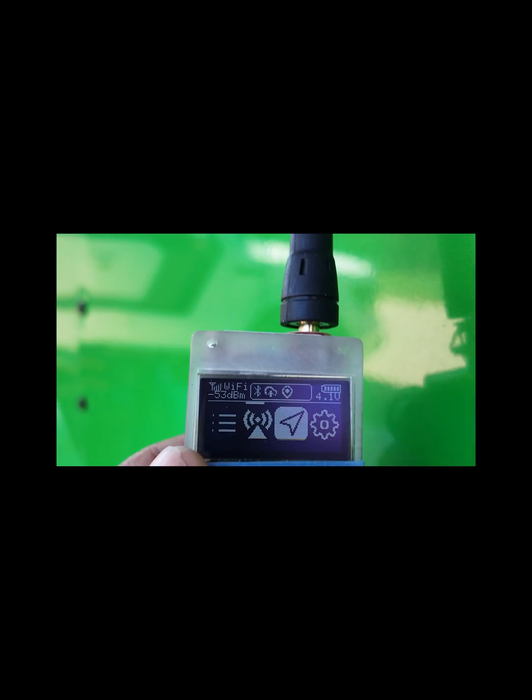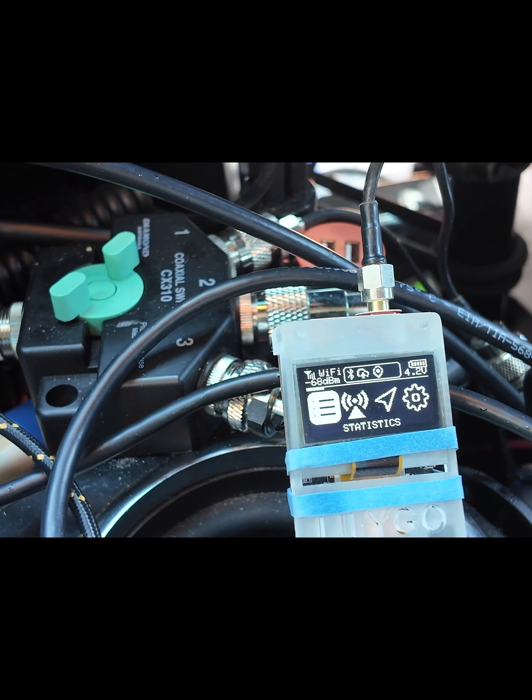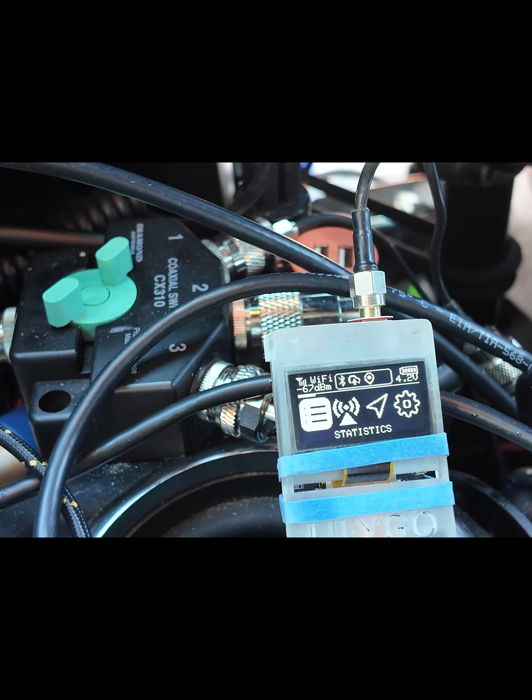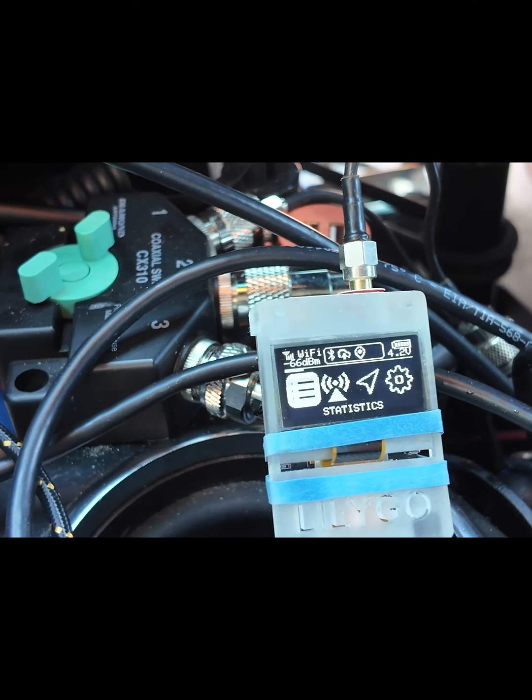If you look on top here, it's got a GPS. This antenna on top is a VHF antenna and it's SMA, so I just unscrew that antenna and hook up the one that's on the truck. This has been doing the job. When it's in the truck, it's sitting in the cup holder hooked to a 2-meter mag-mount antenna on top of the truck.